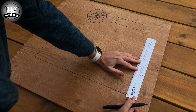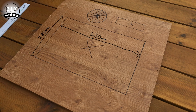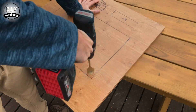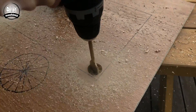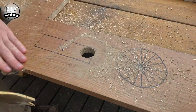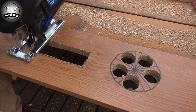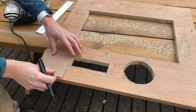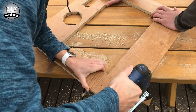For the monitor I'm using — there's a link in the description below — I'm going to cut a 285mm high and 430mm wide square cutout, centred width-ways and 100mm up from the bottom. Don't worry too much about the quality of the cuts, as we will print some plastic surrounds to tidy up these openings. Finally, I'm going to add a 100mm radius to each of the four corners on the two largest pieces of wood.